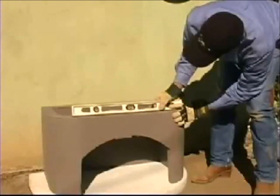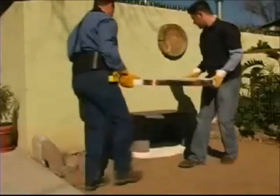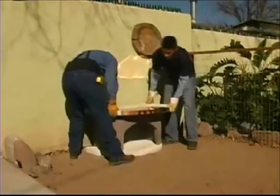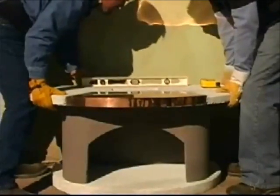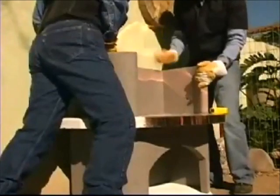The firebox ledge is set on top of the wood storage base. Center it from left to right. Now we're ready to assemble the firebox. It should be centered and aligned with the wood storage base. The inner firebox is made up of several pieces. Take a few minutes to be sure the pieces are properly oriented. The grooves should face the inside fire area. On the side pieces, check that the edge that is beveled faces forward.